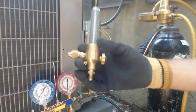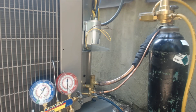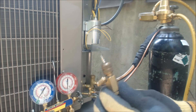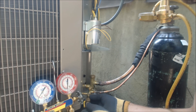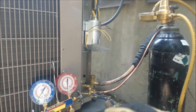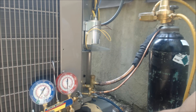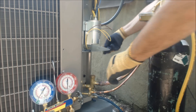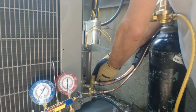We've taken our flow reg off of the nitrogen tank. I think we're not going to have any leaks on this, so I'm going to put the Schrader valves back in. Make sure there's no dirt or anything on the actual Schrader valve before seating them, otherwise they won't seat properly. You don't need a fancy tool for this — it's just what I grabbed out of the truck. A $2 one works fine, available at Napa or AutoZone.